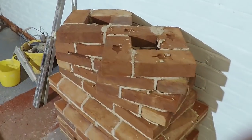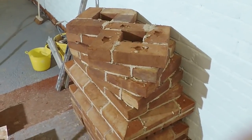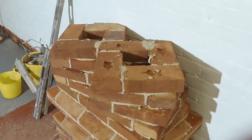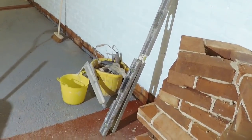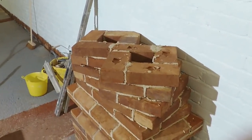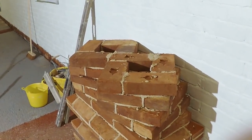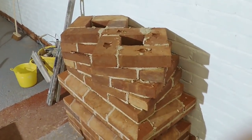I've done a twisted arch, I've done the triple twist, as you've probably seen here on YouTube. And I've done a spiral twist as well, with a half going around a circular column of brickwork. But all of those, I can use the tool that is up on my bucket there. But the twist that we've got coming up soon is a tapered twist. So as the twist starts, it leans in on three sides. So the twist continues round as normal, but it reduces in size on three sides.